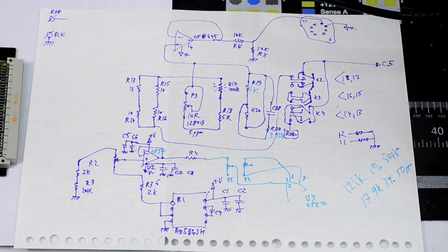So for example, if somebody wants to measure very accurately a high power shunt, like a 100 amp shunt or 1000 amp shunt, which often can have micro ohm resistances, then you would use the bridge together with extenders. So the relay K4 is related to routing the current outside of the bridge, so it can be ratioed, and then the extender has its own DCC transformer, so you could get higher ratios. The bridge itself can do only ratios up to 14, so either the resistance you measure should be less than ratio 14, or with the extenders you can do ratios like 100, 1000 and so on.